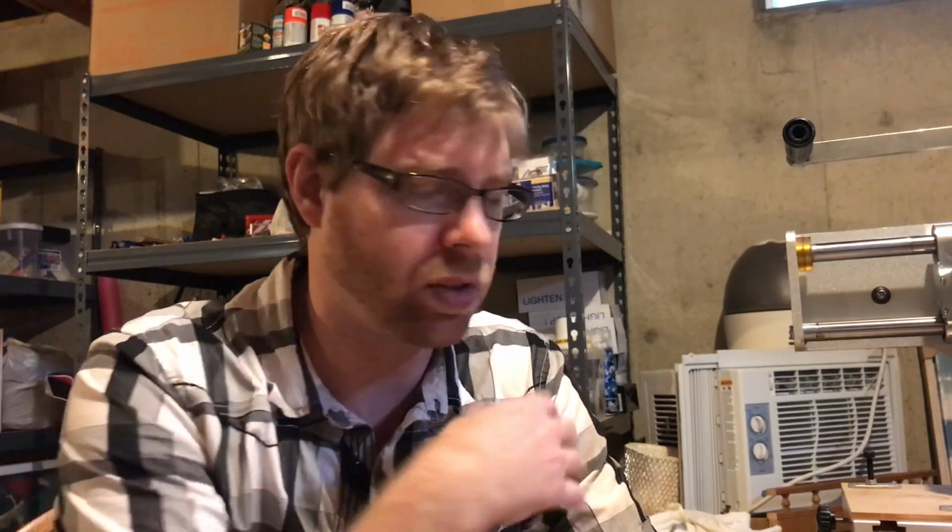In a future video I'll talk more about the different dial materials and printing on them, priming them, that sort of thing. Probably maybe in the next video when I actually show me printing on the dial. But I'm finding out in my testing that this pad printer and multi-purpose inks print really well directly on 3D printed PLA plastic. So I think I'm going to be making quite a few custom watches that have just direct pad printing with multi-purpose ink on PLA dials that I've designed. I think it's going to look really cool, really unique. So that's one thing I'm working on.